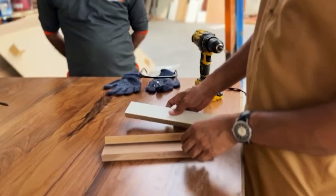First, we are going to put a direct screw into the China MDF in the middle without a pilot hole. You will see — if you directly drill, it will break. Now this is India MDF. In the same size, we will drive a screw directly into the middle. Let's see how India holds. It is comparatively better, but it still breaks.